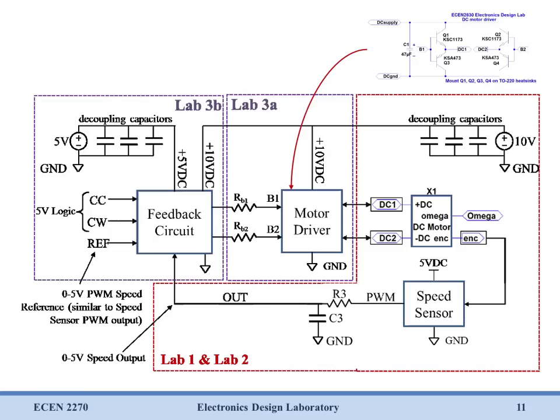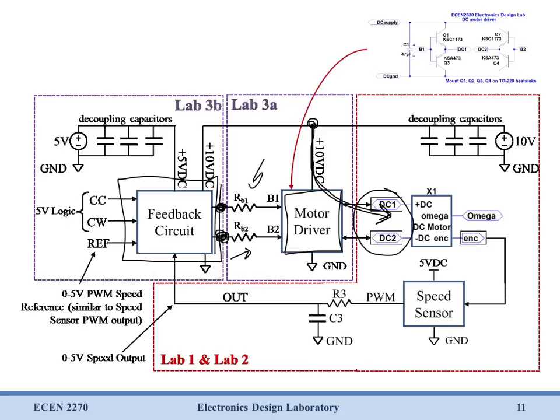Once we've selected RB, we simply put it in circuit. Remember, these are two control inputs, so we're going to connect those somewhere between 0 and 10 volts, and we have a motor driver. The output is going to be some variable voltage to drive our motor somewhere between minus 10 and 10 volts, and all the power for that is going to come from our voltage rail — not from our control signals, which is exactly what we wanted. We can hook this up, and once we have it working we can deal with making a controller to generate these voltage signals, but that will be in a future lab.